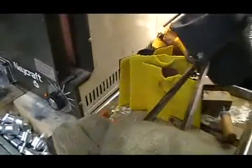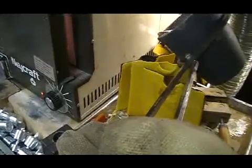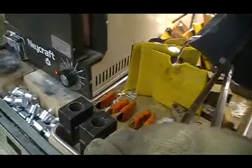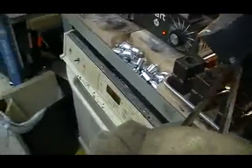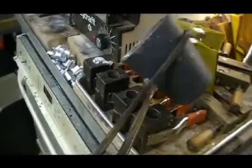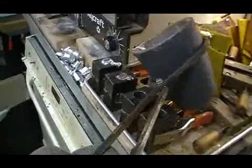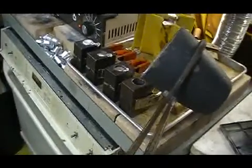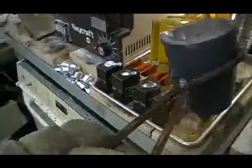First thing I'm going to pour is the sand molds for the Penbase, and again, I want to do it very carefully. Not only is the metal very hot, it's also a liquid, which adds to the safety issues because it can pour, drip, splatter, splash. Now I'm going to fill some of the molds for the tape dispenser roller, and we're going to fill those up. Once we're done, we'll place it back in the furnace. And you can see those are smoking and actually burning.